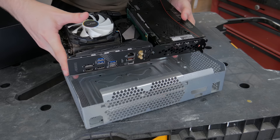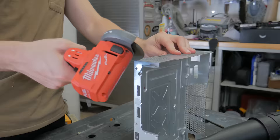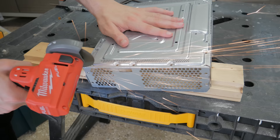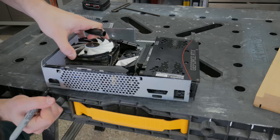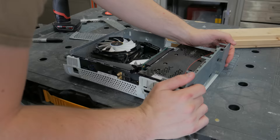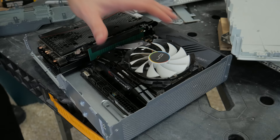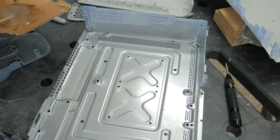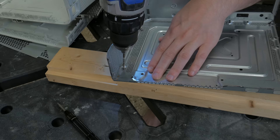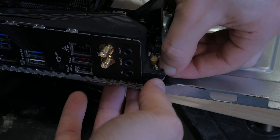So I pulled out the cutoff tool and got to work. I started by removing an angular bent-in part that might get in the way, then removed one of the sides to make room for both the motherboard and graphics card. I marked where the back IO was going to be and cut off the majority of the back metal panel. I held the motherboard in place and marked the 4 mounting holes with a metal punch, then drilled them out and decided to mount the board with bolts from the bottom and nuts on top — less elegant but considerably more solid.